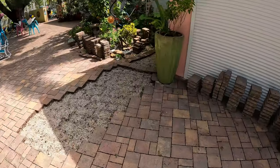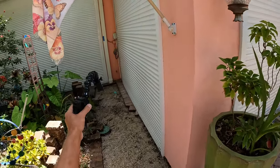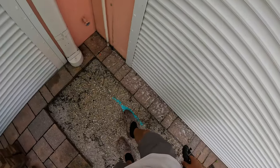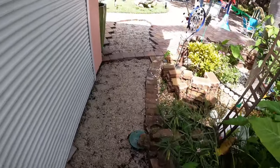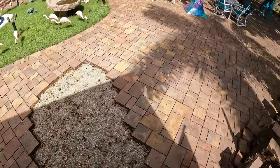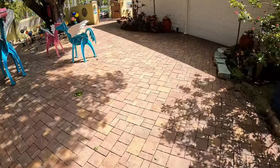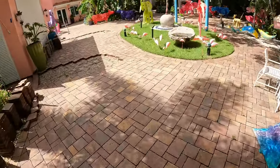And then over here, same situation with the concrete curb. These pavers are thin set onto that concrete curb. There's a gutter that's been there over there. You can see the pipe right here, and I believe this is a 6-inch. There's a new gutter going in right here, so we're gonna tie these two together and run 6-inch pipe down to there. And then there's one on the back of that purple house that I have all the pavers picked up at, that we will go do last.